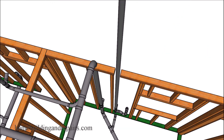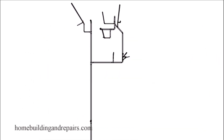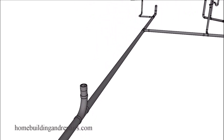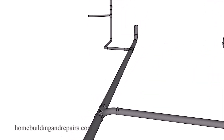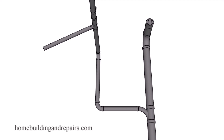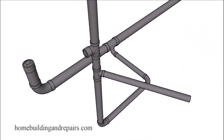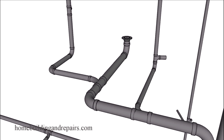Next up let's remove the upper framing and the floor joists so we can get a different view of the plumbing — no foundation or upper framing here. If you need detailed information about the pipe fittings, let me know in the comment area and I'll go through and name each one. A view of the kitchen sink and the clean outs — we have two clean outs: one for the four inch line and one for the inch and a half line.